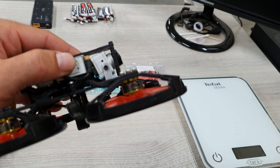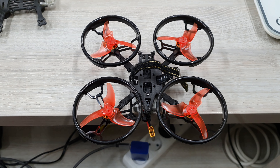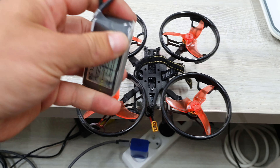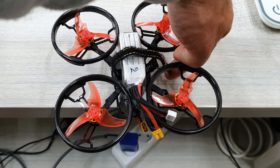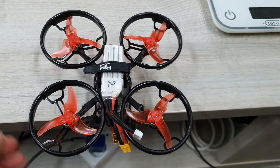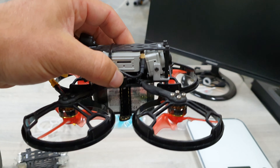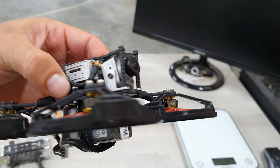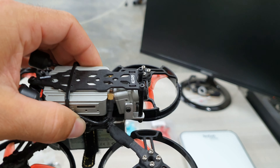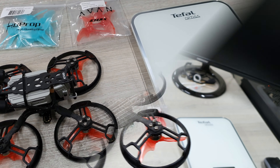Because we went to a pusher frame, the props are pushing the air downwards and the props are below the motors. The ideal battery to use is the Tattu 650 milliamp 4S — they really fit nicely between the prop guards. There's a little play but you can strap it down tightly, connect the power lead, and the battery is not going anywhere. The center of gravity is really good — the battery, which is the heaviest thing, is in the plane of the props, making this a very stable flying machine with weight well distributed left to right and front to back.